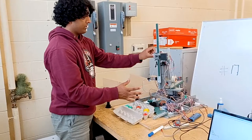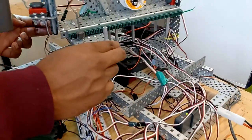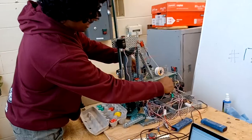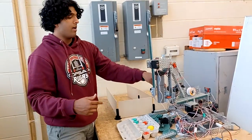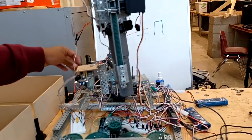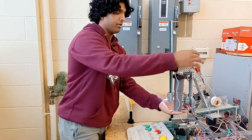The final stage was the moving stage. This is a three-axis arm, so we have the turret down here controlled by a potentiometer. Each motor is actually controlled differently — this motor is a potentiometer. The reaching motor right here uses an encoder on the bottom that tells us how many steps we've done. And then there's a large DC motor that's controlled just by a limiting pin, because this arm only needed top or bottom — it never needed to go in between. So there's this large motor with just a limiter here and here.